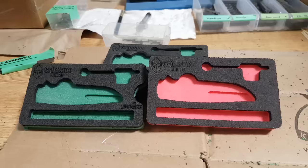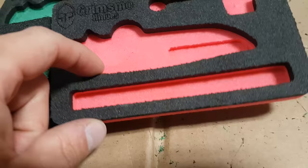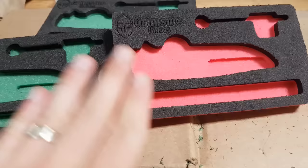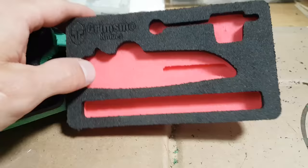Here's a quick side-by-side of the red/pink versus the green. Now let's take a quick look at edge quality. The Lakeshore carbide three-flute gold-coated end mill leaves edges just a bit frayed and burry. The Datron end mill leaves a way crisper edge — utterly fantastic quality. Once you see them side by side you can really tell the difference. This is actually the first moment I've had them side by side — definitely worth it.